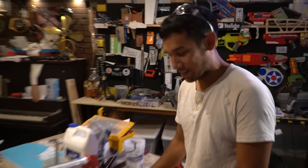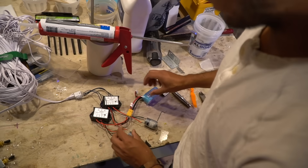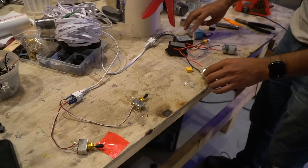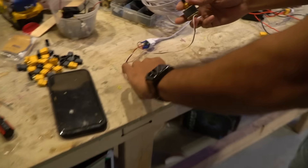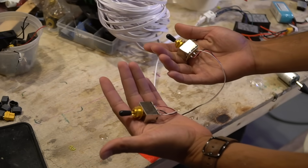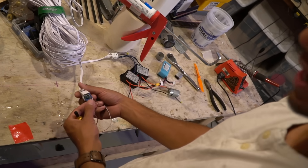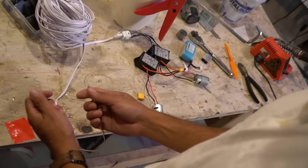It's time to test the submarine parts. I found these four reverse relays. The thing I'm very excited about is that the battery is actually on board with the submarine, like the fancier ROVs that you can buy. I plug this in and I have these four reverse relays. I have over 100 feet of ethernet cable which will transmit data to the sub — telling the relays to go forward or reverse and send video signals to the surface. I have these simple single pole double throw switches, so if I throw them it does this. The ethernet cable has only eight lines of communication — well, technically seven because you have the ground — so I have just enough to make this work with video.